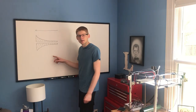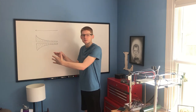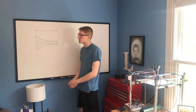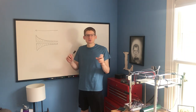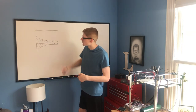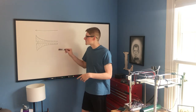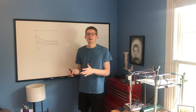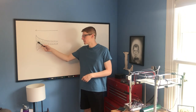I previously proposed something like this — an altered coil geometry whose windings favored one side, specifically the front. This represents the cross-section, and these areas would be the coils. The idea with a coil geometry like this is that the effective center of the electromagnet would be right around here, somewhere very close to the front. When I say the center of the electromagnet, I mean this is where the projectile would be pulled to. If you left the coil on for a good amount of time with the projectile in it, it would settle with its center of mass at this point.